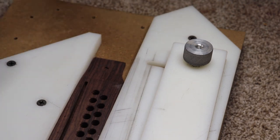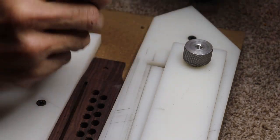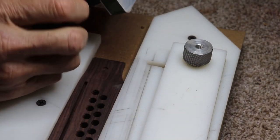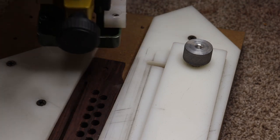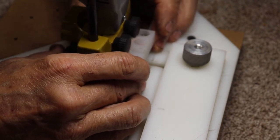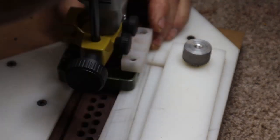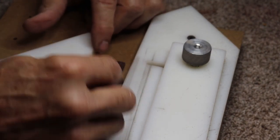I'll move out just a little bit and test again. It's testing at 57, then 54, then 56 thousandths — it's hard to get this thing perfectly level when you're measuring that fine. I got it down to 47 thousandths. I'm going to try a little different spot because of the slight curve. It went to 46 — so I maybe went a little too far. I'm going to tighten it back up just a hair. I'm going to call that good enough and try it. I think that's going to work — both of those will work.